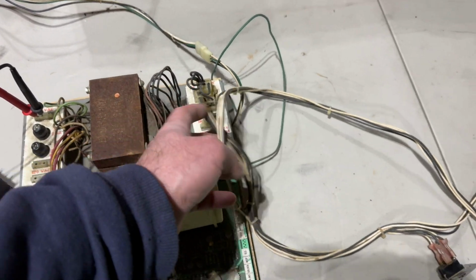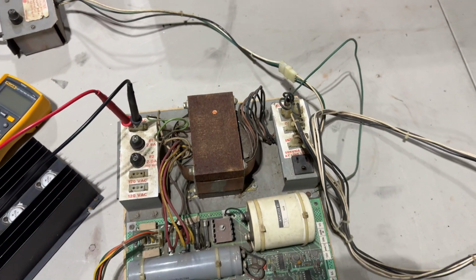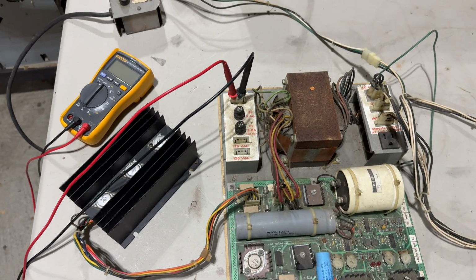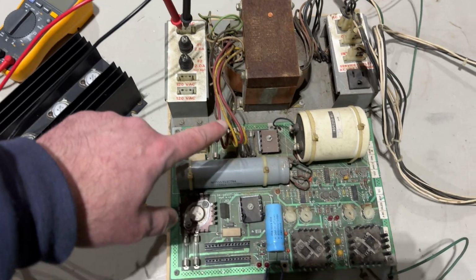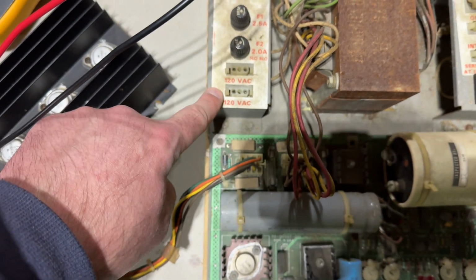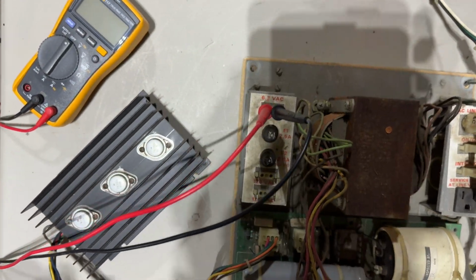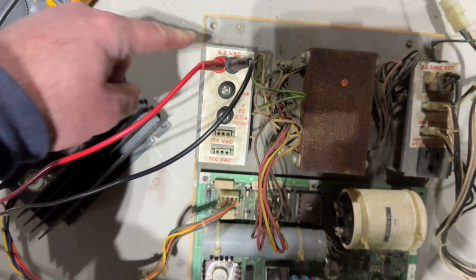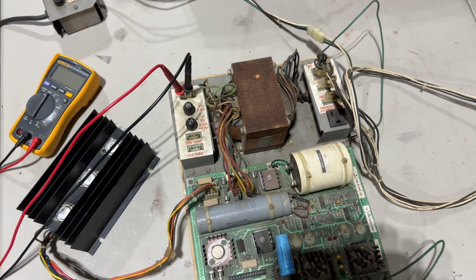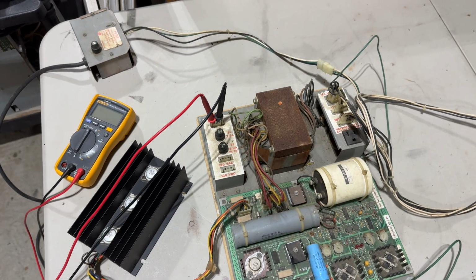And then that comes through here, and that's all just to provide AC voltage to the isolation transformer and the rest of the power supply. And I've been spending some time with the schematics, figuring out what's going on. And then that feeds AC into the isolation transformer, which does a couple of things. It breaks out a couple of voltages, so it sends a bunch of voltages to the power supply board. It also sends voltages over here, gives you line voltage for the monitor, and I think potentially for a marquee light, like a fluorescent style marquee light that we don't use in this cabinet. And there's also this 6.3 volts AC outlet for the incandescent bulbs in, I'm assuming, the coin door and that light up the instructions on the bezel.